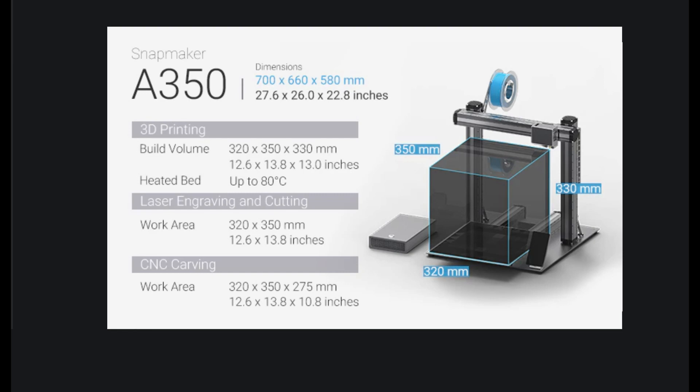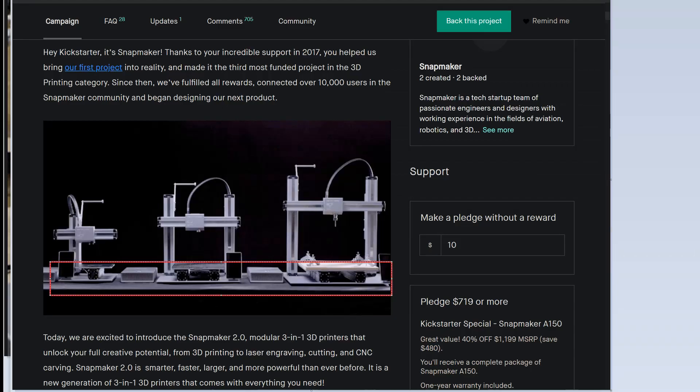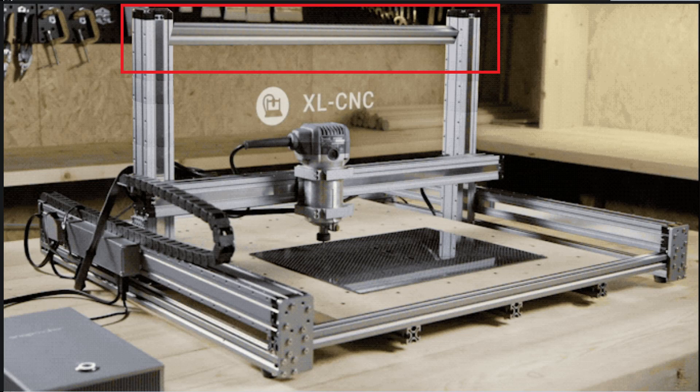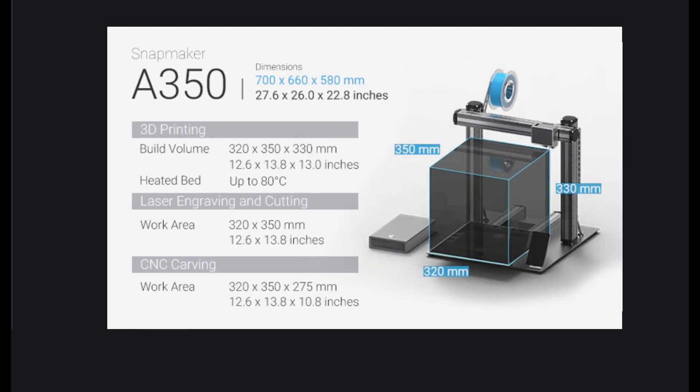Speaking strictly about the current Snapmaker 2, the A350 and maybe the A250 — I'll leave you with some questions rattling through my head. The aluminum bed looks like all the other aluminum beds: could it sag under its own weight and size? How about the base — will it sag as well, since there seem to be no reinforcement rails like on the XL CNC? How does the X axis get synced between the left and right Z axes? If they get out of sync, could the X axis tug on the vertical rails, slightly bending them and affecting the assembly? Could a connecting horizontal T or V slot rail, connected to the Z axis, prevent the entire assembly from bending under pressure? I'd also like to see what's under the base of the A250 and A350, because I think they may need some reinforcements. Well, thank you for watching — that was my rant.